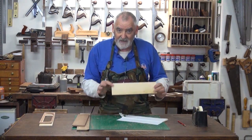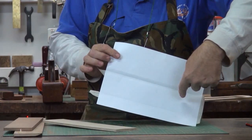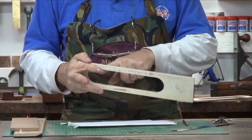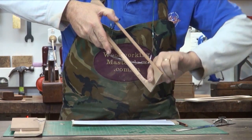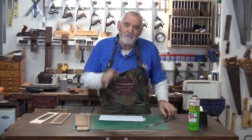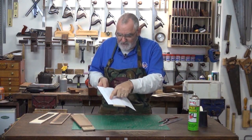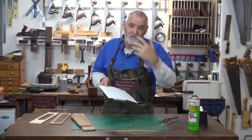With that piece of plywood we had left when we were cutting the templates, place this piece of paper with the creased pattern on top. I actually glue these down, and now with a compass you've got to play around a little bit to find the right radius for the inside curve, and then draw that curve in. Go over to the bandsaw and cut this shape out almost exactly — leave it a little bit fat, because I want to clean that up using a spokeshave or a block plane.